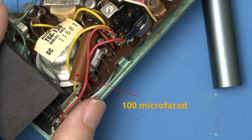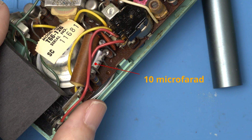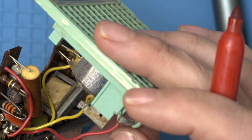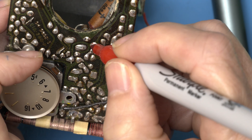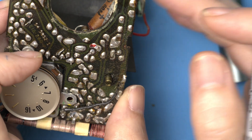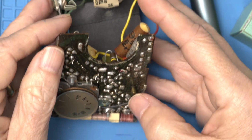These are both axial caps, which are hard to find these days. So we use radial caps and a little heat shrink tubing, and that should work out just fine. I'm going to mark where I think the desoldering goes — I can see basically where it goes. This way I won't have to keep switching it back and forth quite so many times. That looks right, so let's get going.